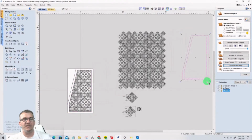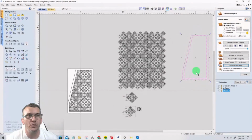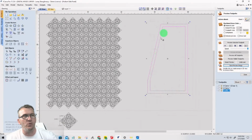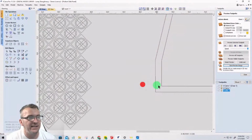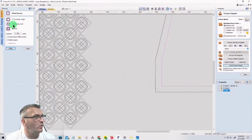So let's say that that's my cabinet side, right? And the line, that offset, that's a 3/4 inch offset. That kind of represents where my drawer fronts and stuff like that are. It really doesn't, I just want a nice little inset pattern. Now with this, I need a trim line. I need a boundary. So I'm going to take this inside vector and offset it inward 1/8 of an inch to kind of match all the rest of those spaces and everything.